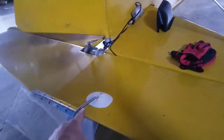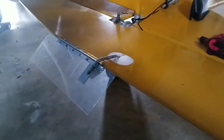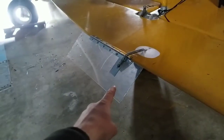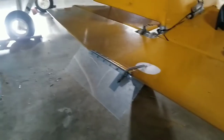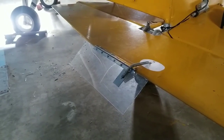I put it on the other way. If you remember, the plan was to have the cable coming from the actuator down the top of the elevator to pull it up, and the spring underneath would pull it down. The problem was once I put the bigger surface on — which is, just for people's curiosity, 18 by 6 — it was overpowering the spring.